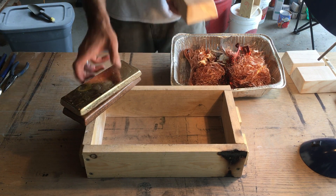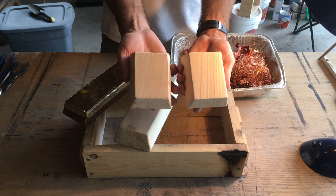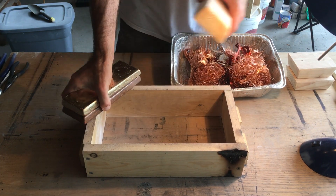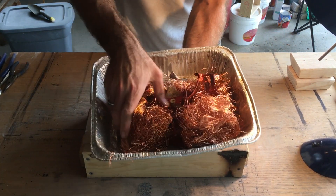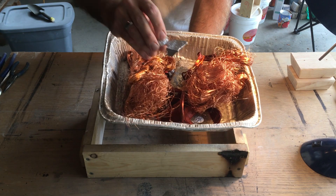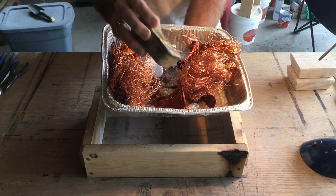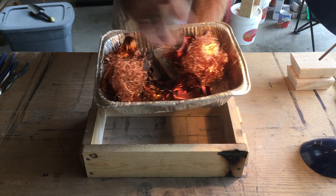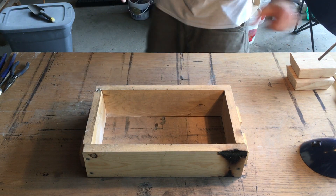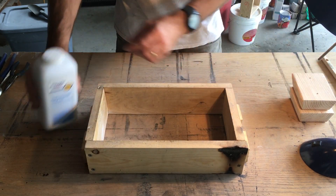We used this mold to make that one. Next we're gonna use these two smaller ones — about two and a half pounds each is what I'm shooting for. Here's all our metal we're going to melt, this is all properly weighed. This will be 11% aluminum and 89% copper. This is aluminum bronze already made, and all this copper is from televisions — I think two or three televisions.